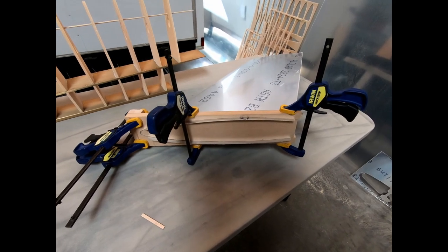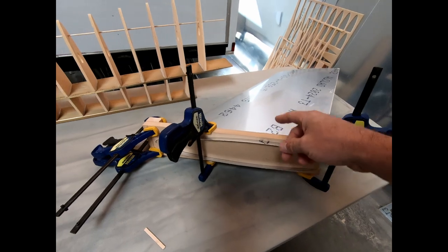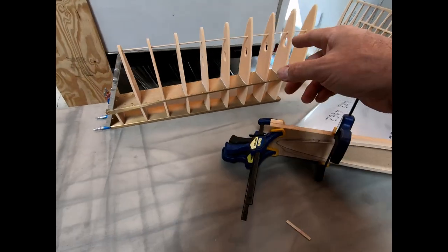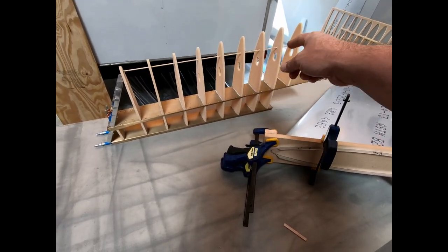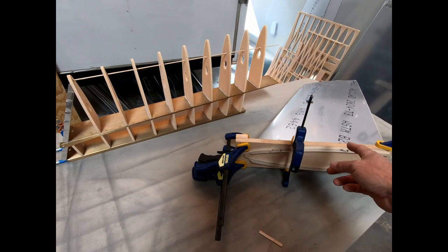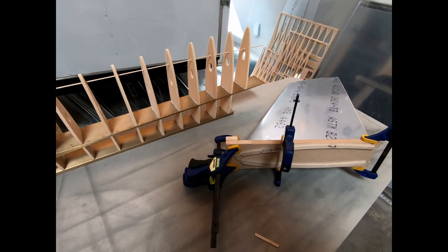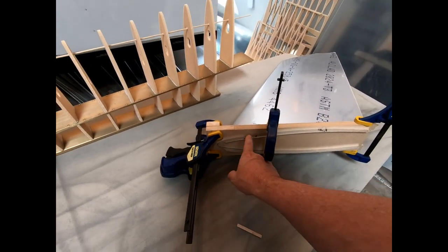So that's what I'm working on next. I'm gonna try and get that shaped so that I can then complete the test fit on the framework there. But the other thing I'm going to do is get that rear fuselage back out, and put this framework temporarily in the rear fuselage where it's supposed to go, and put the skin on it temporarily just to make sure that everything's aligning, everything's fitting right, that my rivet holes here are going to match up with the rivet holes that are already drilled